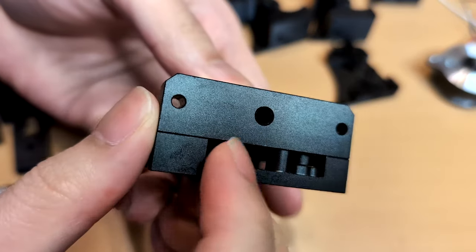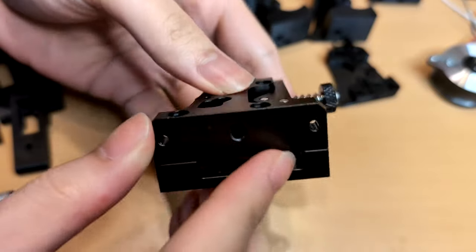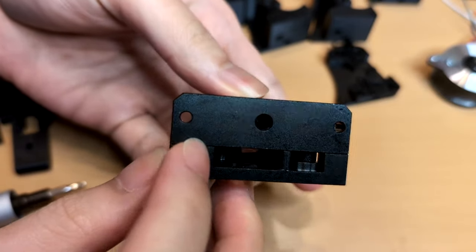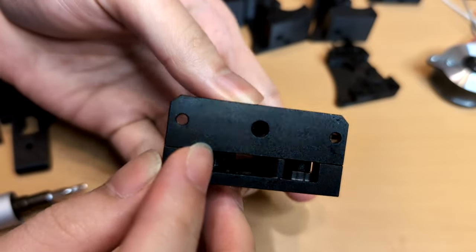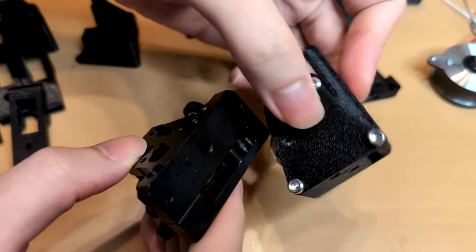Well, the aluminum extruder has two holes for fixing it in place. This setup requires an additional adapter between the hot end and the extruder. By building my extruder with custom holes, I can reduce the weight and space needed for adapters.